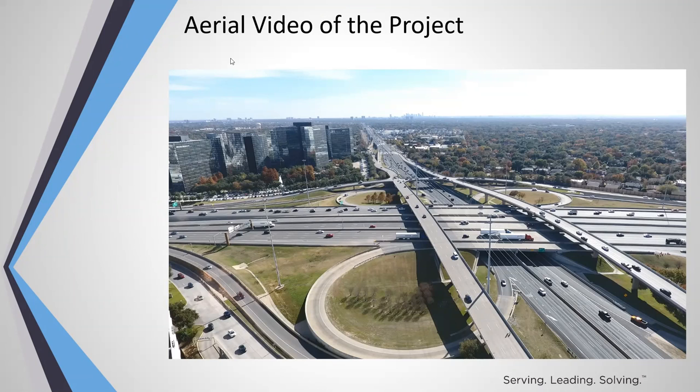Those exposed anchor bolts will really tear your car apart — they're pretty stout. Regarding the question about the concrete foundation swaying in heavy wind and the catwalk impacting the bridge: no, we've been out there on heavy and light wind days and that column is not moving one iota. It's a four-foot diameter column, some of them over 20 feet in the ground, built to withstand that wind loading. So far nothing is going to scare anybody as far as the crow's nest impacting the bridge.